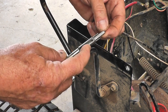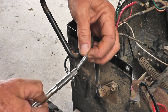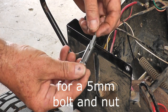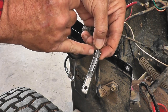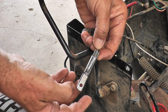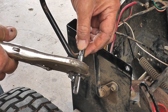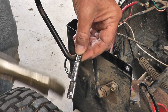Getting there — just going to open this bit up a little bit more to allow that to pass inside, then I'll crimp that back on there and squeeze it over the line. Before I do that, I'll mark it, cut it off, flatten this piece, and drill a hole through it. I've opened that up with a chisel and I'll drill a 5.5 mil hole in that. The plan is now to slide that up so the shoulder is level, crimp that — I'll probably use a pair of vice grips — and then that should bolt in place.